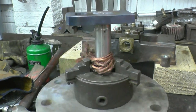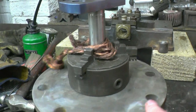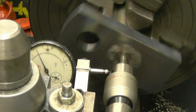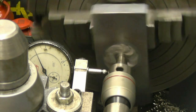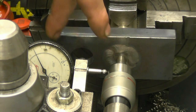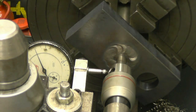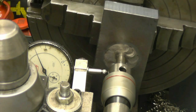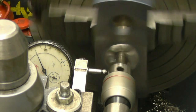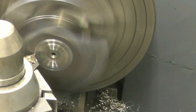I've got some copper wire onto the welding table which I'm eventually going to use as a strap with the electric motor and the copper cable — just to make sure I get a really good earth. That's running there within a couple of tenths at the most. So we're going to run a cut across this face, take that weld off. I've actually got to take — I think it's a mil and a half off — to get this down to 14.3, and we'll machine the other side when the cranks are assembled, take the 0.3 off there, and that brings the crank webs out to 14.